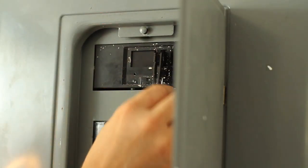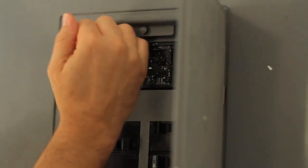We're now ready to install the TED 5000. As the installation manual clearly states, although installation is very quick and simple, we do recommend that an electrician or some other certified individual installs the unit in the breaker panel due to electrical hazards. Andy, one of our engineers, is here to assist. The first step is to turn off all power to the circuit breaker panel by turning off the main breaker or main switch.